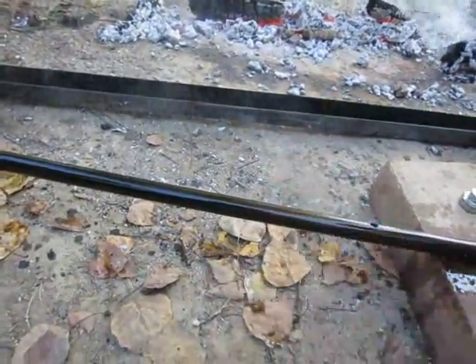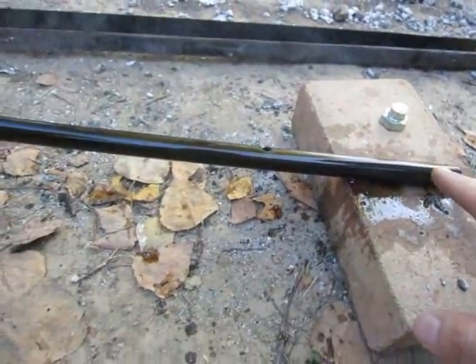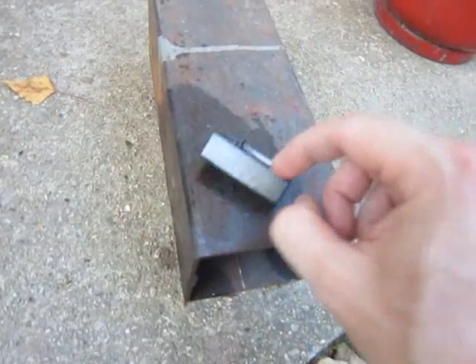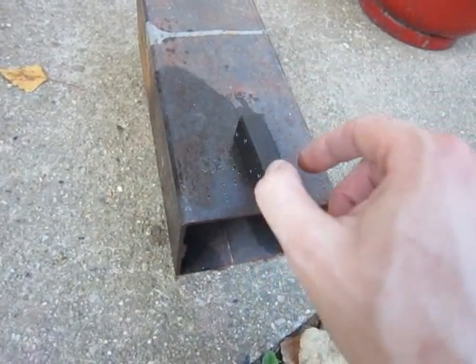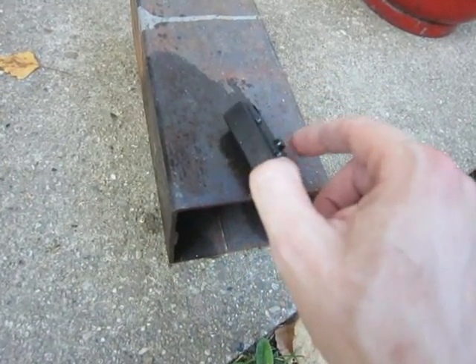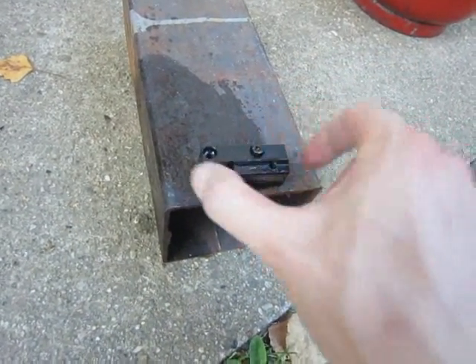I'm feeling the heat — it's very hot. I think this sand is hotter than this one. Here is my parting tool — it also became dark. The thing is this is made from steel that can be hardened in oil, so I just wanted to try without a lot of studying what will happen when I put it in high temperature.